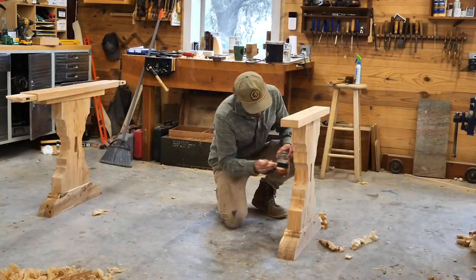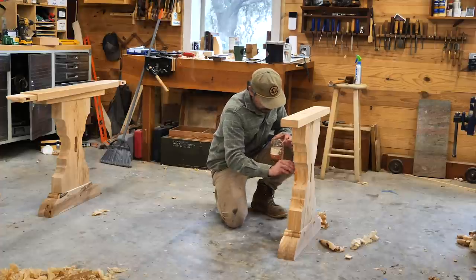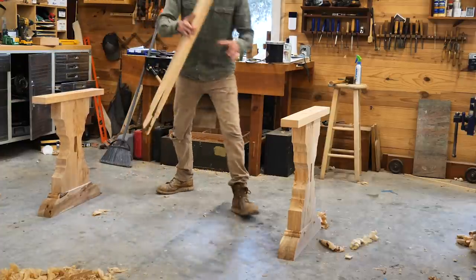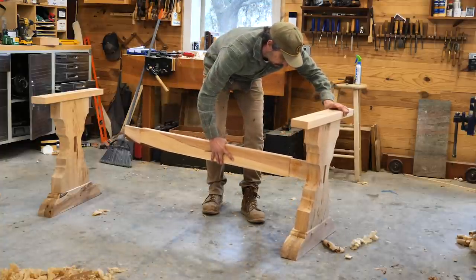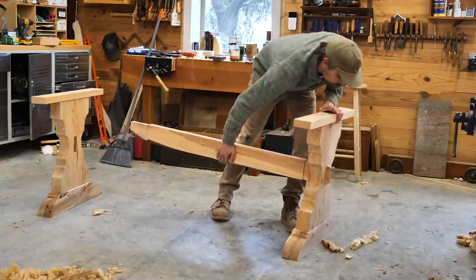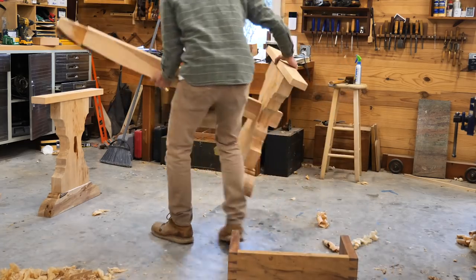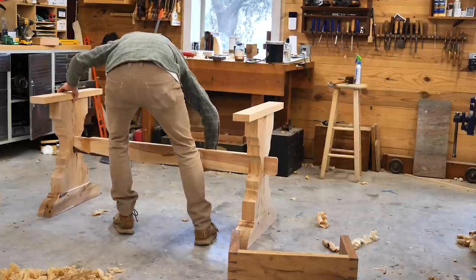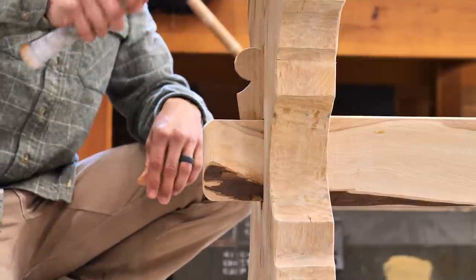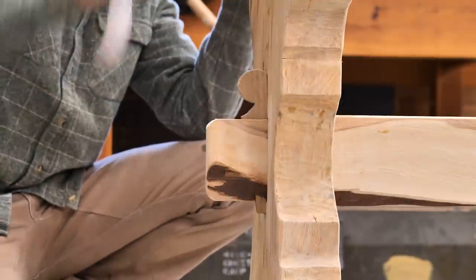Next step is to glue it up. I'm using hide glue again — same thing we did on those uprights — just to stay true to this kind of old school first century build. These, like I mentioned earlier, need to go in pretty loose because we need that wedge to be effective to pull it tight together. I don't put a lot of glue on it because mechanically it's getting locked in place, but it doesn't hurt to have a little bit of glue in there. You can completely leave it dry and disassemble — that's one of the advantages of this wedge joint. If you really wanted to disassemble it you could heat up that hide glue and get it all loose. This is the first time I've done one of these wedges and it's amazing how effective they are pulling that joint tight and locking everything together.